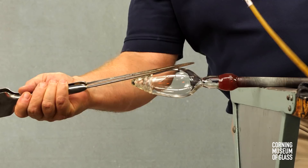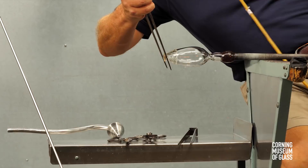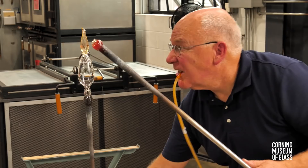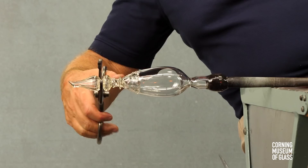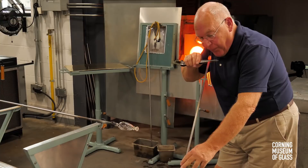A tiny bit of glass is added to the tip of the bowl, and a merese created. A bubble of glass dipped into the 12-ribbed optic mold is lowered into place. A narrow constriction is immediately made near the merese, and two more constrictions made — one decorative, and the outermost will allow the excess glass to be broken free. The cup is transferred to a punty, and the narrow constriction near the blowpipe allows for easy, clean breaking.